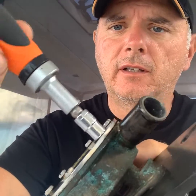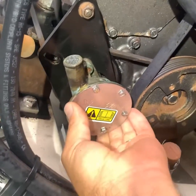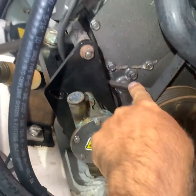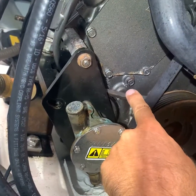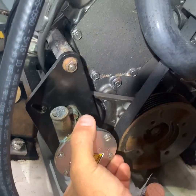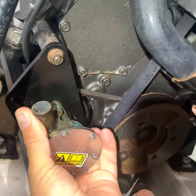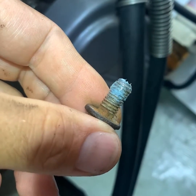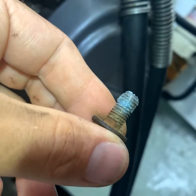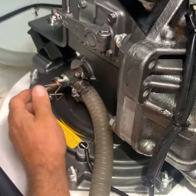When you put the pump back on, make sure you don't over-tighten the belt — the belt must flex a little bit like this. Don't use any tool, just use your hands to adjust the belt tension. Use some blue thread lock on the three bolts, put back the hoses, and remember to open the seacock, and you're good to go.